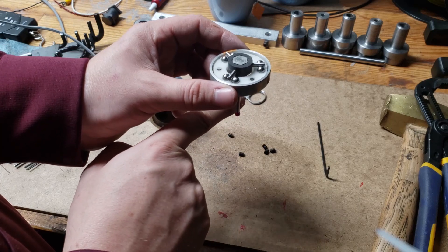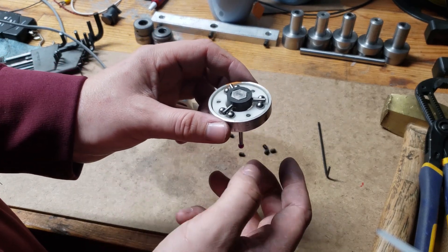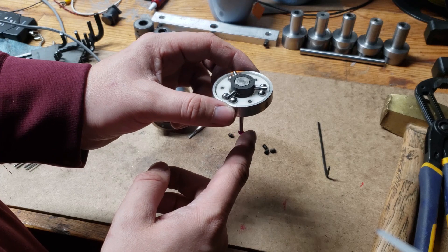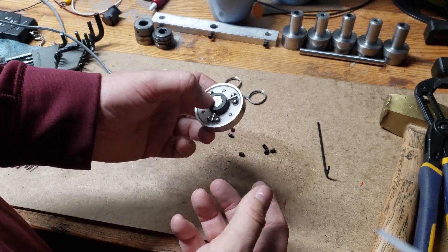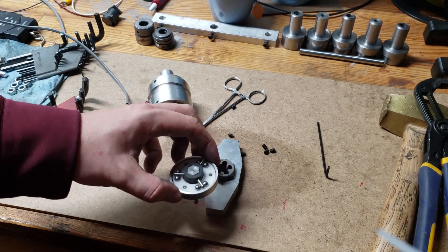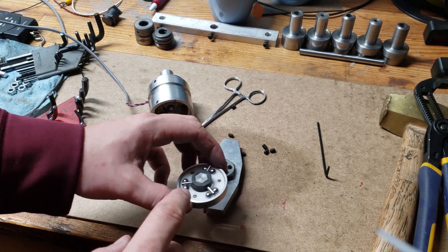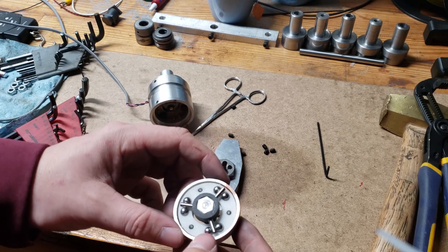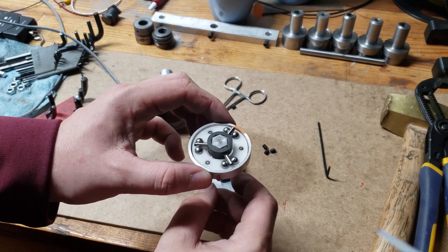The trigger — the distance needed to move this probe tip in thousandths of an inch — differs depending on the angle of attack, and that throws off your indexing. If you're trying to find a corner and you probe in two different 90-degree directions, the probe takes more movement in Y than in X to activate, so you'll be slightly off in Y. It's very small, but it is there — and it is correctable because it's repeatable, just like we just saw with this three-legged system.